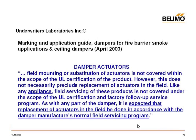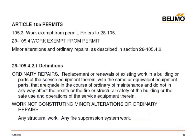A couple of nomenclature items from UL. UL doesn't really certify any replacement. It's basically up to the AHJ — the authorized authority having jurisdiction — but primarily it's either the building code or the fire marshal who will have final say. Ordinary repairs on fire dampers and smoke dampers need to be fixed, so you can change Belimo motors. There are some different forms you need to fill out. Call your industrial controls rep and we can come in with Belimo.